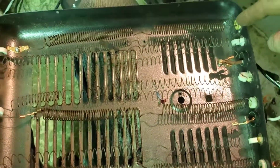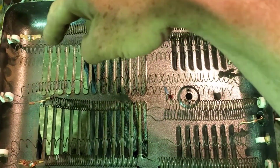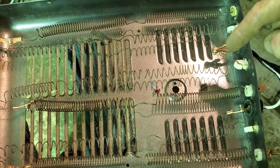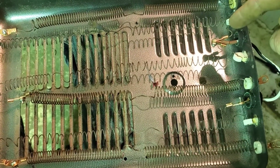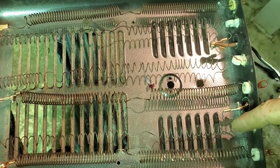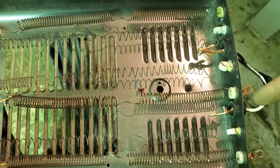So that's just one start here, goes up to there, and all the way back down here, connected together to this one. It's just the three phase — that's an end, that's an end, that's an end — and these are the starts: one, two, three.